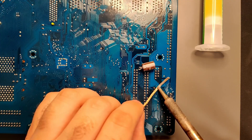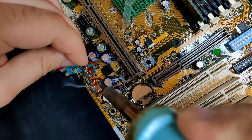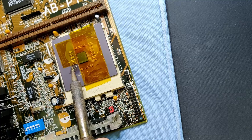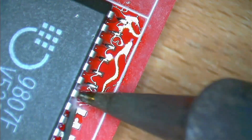You have seen me soldering quite a bit on this channel, be it replacing worn-out capacitors, adding pins to motherboards to measure voltages, relocating SMD components to unleash massive amounts of level 2 cache, or making EDO chips behave like FPM chips, and much more.